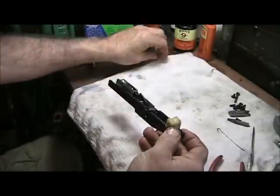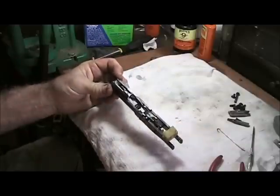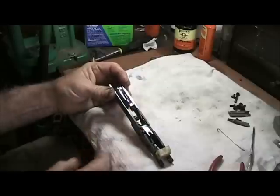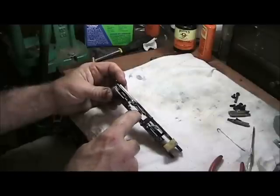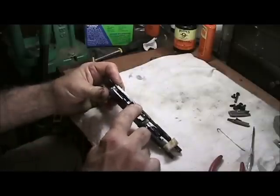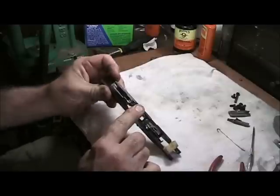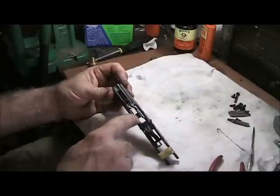Well, okay, folks. I'm back now with this fully reassembled and thoroughly cleaned unit here that houses the loading throat, the hammer assembly and spring, the ejection spring and loading lever. And actually, in this particular model, this spring does not act as an ejector. There's a raised edge here on this loading throat that acts as the ejector. However, that spring also is what's responsible for loading each and every cartridge. As the bolt moves forward, this comes down, a round is fed into the loading throat and then pushed up by this lever here that's spring loaded.